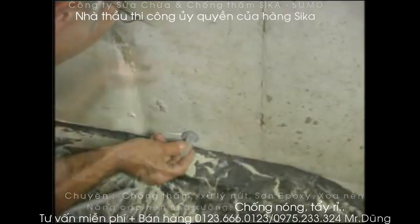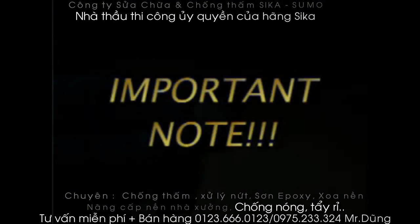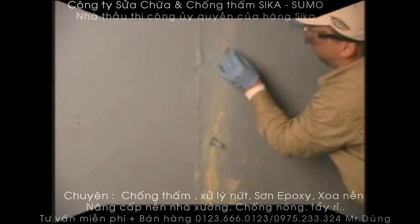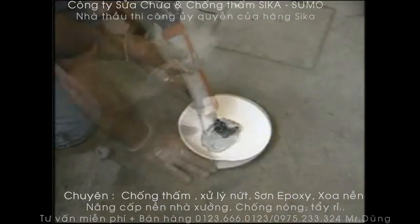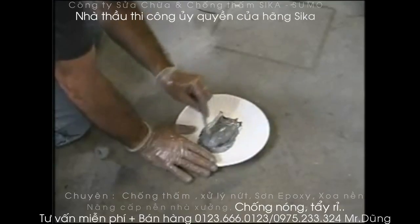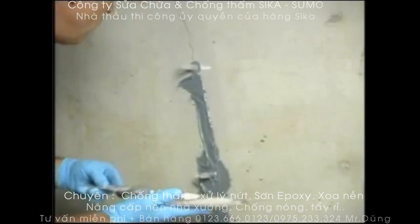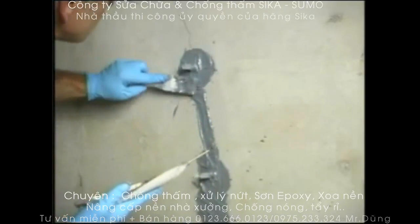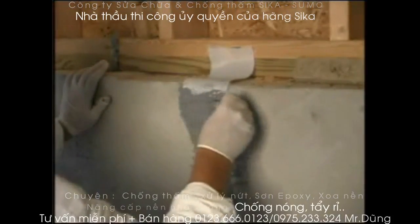Place a port over the crack at each pre-marked location so the entire crack is ported. Do not allow the adhesive to block the bottom of the port opening or the crack under it. For sealing the crack, dispense approximately one-third of the tube of removable surface seal onto a pallet and mix thoroughly. Do not mix more than one-third at a time, as excess mixed material may harden before application can be completed. Using the plastic trowel, apply mixed removable surface seal one-eighth of an inch thick and about two inches wide along the entire length of the crack. Apply extra material around the base of the ports to increase thickness to about one-quarter of an inch. When you come to the top of the crack, embed a starter tab — a piece of cloth or duct tape — into the surface seal.